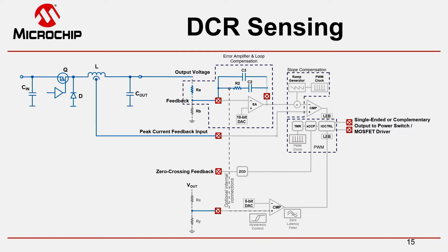Now we are removing this current sensing method and adding our parallel RC network. The components of this RC network need to be tailored to the inductance. What interests us now is how we can get the signal generated in this RC network into our feedback loop so that we can utilize it to trip a comparator and use it as a feedback signal within a peak current mode modulator.